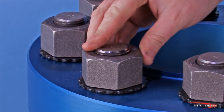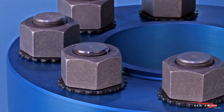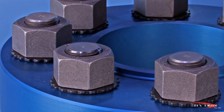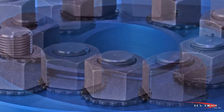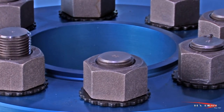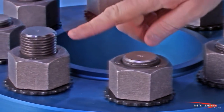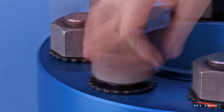The normal practice is to adjust the stud so that when it is tightened, the top end will protrude two to three threads above the nut. This is for inspection purposes to ensure that the nut and stud are fully engaged. There is usually no reason for the stud to extend more than this, and any excess length should be adjusted to the other side of the flange so that the socket can engage the entire nut without obstruction.